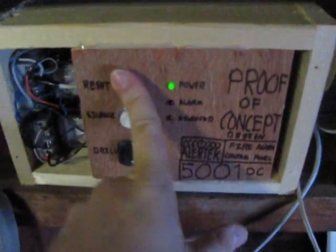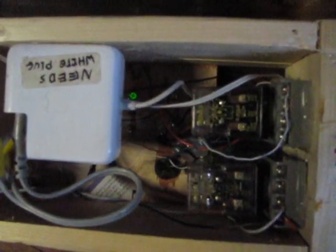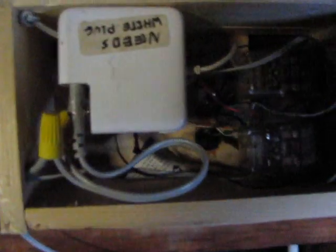You're steady — the pull does nothing. Now I want to see if I can show you how it works. Kind of messy, but it's only proof of concept. The top relay is the alarm relay; the bottom one is the silence relay. Now, how this works is you start with a common — your alarm signal comes in the common wire, turns the relay on. Then when the relay turns on, it connects the circuit, which actually creates an infinite loop to keep the relay on. And then when you press the reset button, it breaks the infinite loop and the relay turns back off. It's pretty simple.